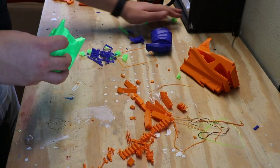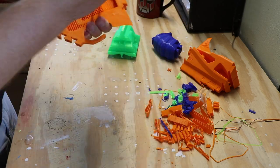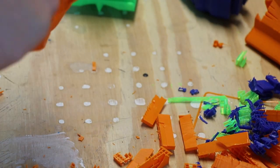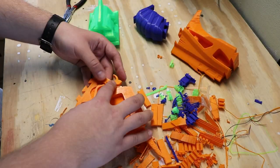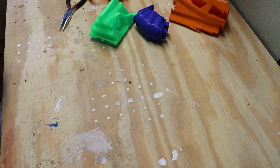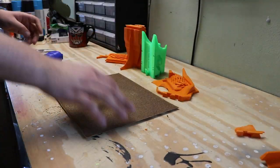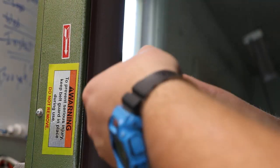After the prints are done, just like any 3D print, removing all the support material is the next step. This was pretty tedious, but thankfully Kirby's supports rip off pretty easily and leave a very clean surface on the bottom. After that, giving everything a sanding with some 80-grit sandpaper, then cleaning up the really rough edges with the belt sander and the drum sanding tool on the Dremel.